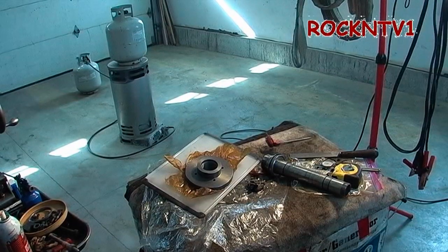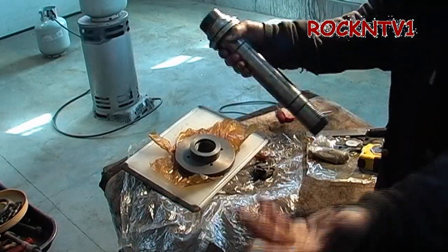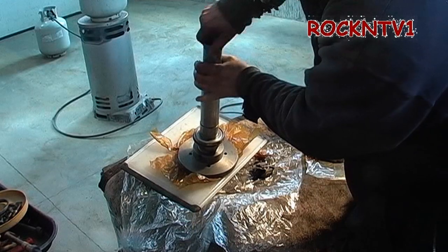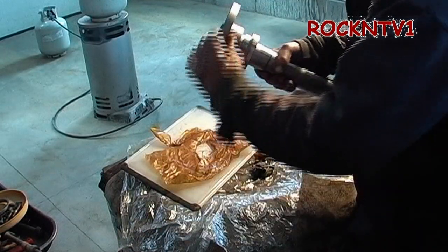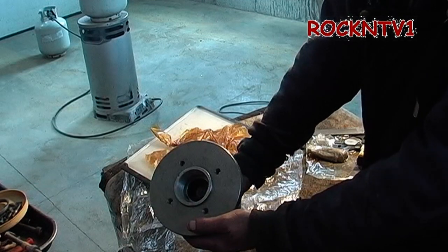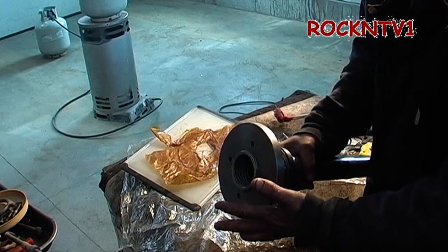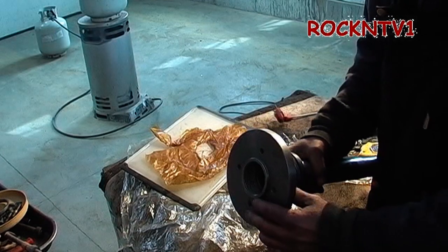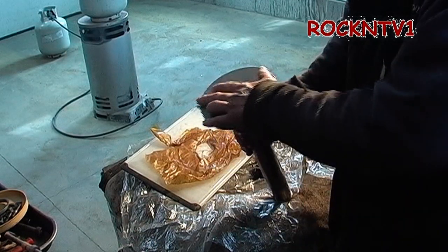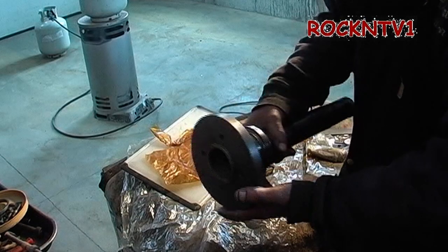So here is the back plate. I can step over here and show you that this is the spindle that I changed out yesterday. This is, best of my knowledge, the original spindle, and it does not go all the way in — it runs up to where the shoulder is and stops. So I got to fix the ID on the back plate. Plus there's nine miles of thread sticking out of there. There ain't a whole lot of extra meat here. I want this on there — I got to have that locating shoulder, which doesn't fit the chuck neither. It's oversized. They did not fit that. I got to fit that, which is why I waited almost four years now.